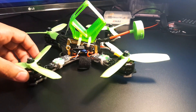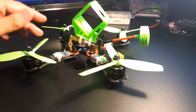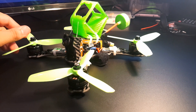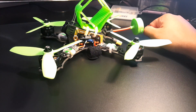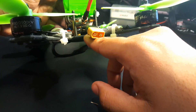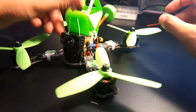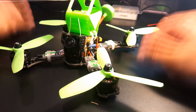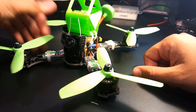These motors felt sluggish — maybe it's a tuning problem. I was expecting something like the Emax 2306 2750 KV, a little more power. I didn't enjoy it, but maybe I just need to tune it since it was oscillating so much. Next flight will hopefully be the maiden after fixes — I'll add the low ESR capacitor to the battery terminals, either on the bottom or the top right where it plugs in. We'll add that 1000 microfarad. That's gonna conclude it for this video guys — I'll see you next time. Happy flying!